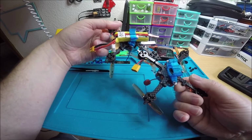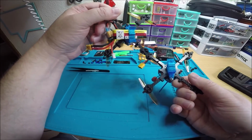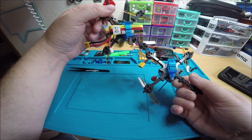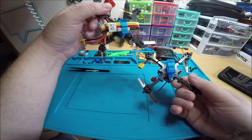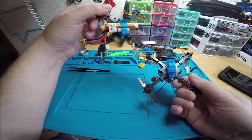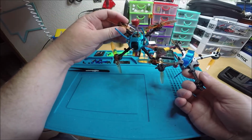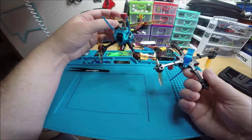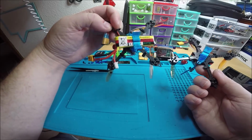It has the exact same holes for the motors. It has 3 holes across the top and then 2 slots on the bottom. So it'll fit any 1103 or 1102 with 9x9 pattern, as well as the AMAX Eno 1103s. It's 2 millimeters thick. Everything else same. It has a whoop style flight controller mounting as well as 16x16.